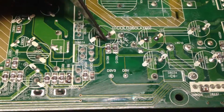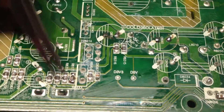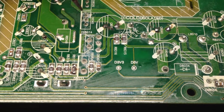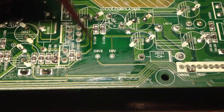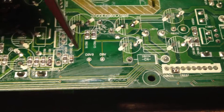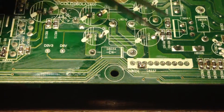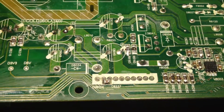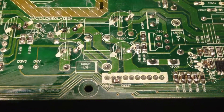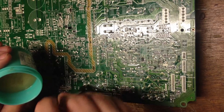So here are the two capacitors I just replaced. I'm looking at the circuitry — there are some diodes and some rectifiers. This is a separate circuit, but they have the same habit of using rectifiers and these capacitors as main filter caps after they come off the rectifiers. So what I'm going to do is pull these other three guys out, take a look at them, check their readings, and maybe just replace them. I'm going to put the foam back in its little cradle and add a little more flux paste.